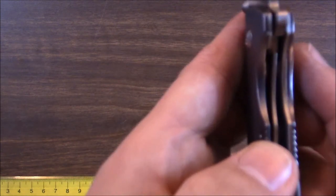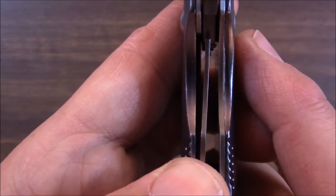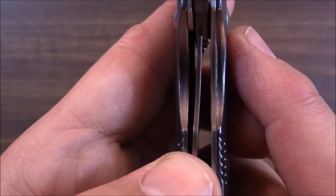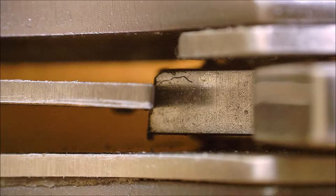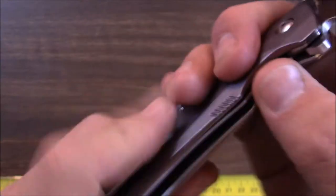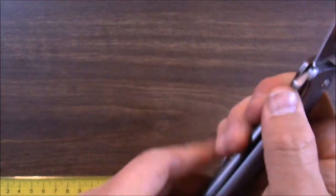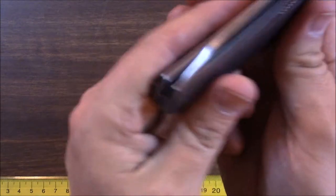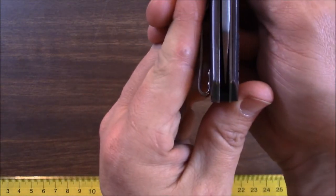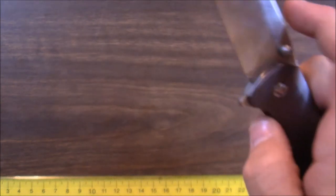The lockup is a little bit early — not quite as early as I like on a brand new knife, but that's being very nitpicky. It's still plenty early enough to have a lot of life in this knife, and it locks up rock solid. No blade play side to side or up and down. The alignment when the knife is closed is just slightly off a little bit to the show side, but it doesn't rub anywhere — it's not that far off.